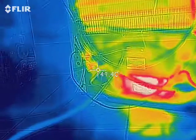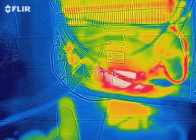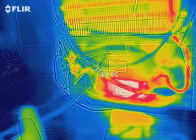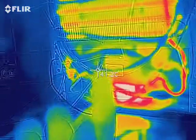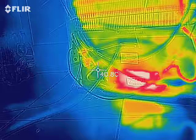You can see immediately that the hose on the left — I'll try to point here with my finger — this hose here on the left starts to get warmer, which is actually the intake one coming cold from the system. It goes in cold and comes out warm, and now the coil right on top of the compressor gets colder immediately. It goes all the way through the coil, and remembering this is a very crude system that I put together just as a prototype.